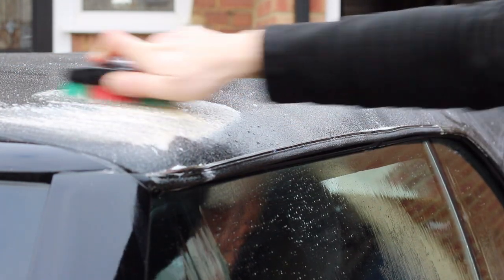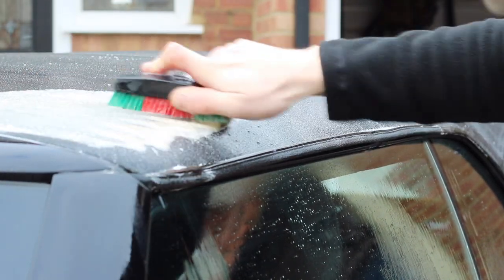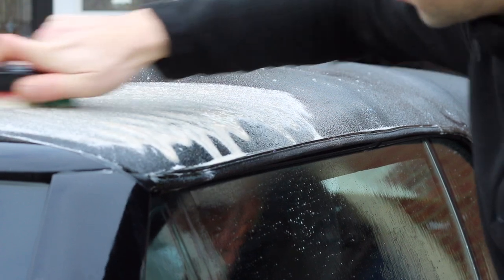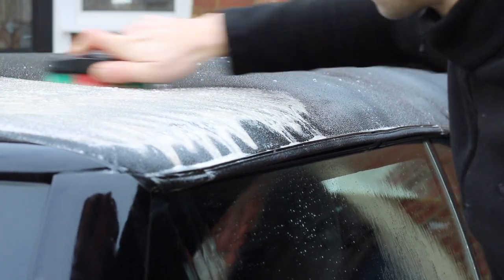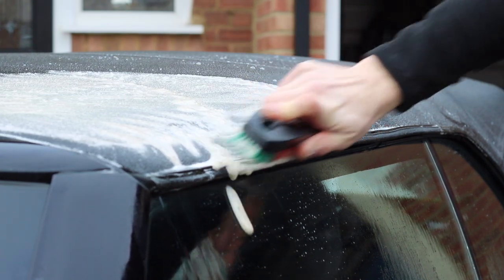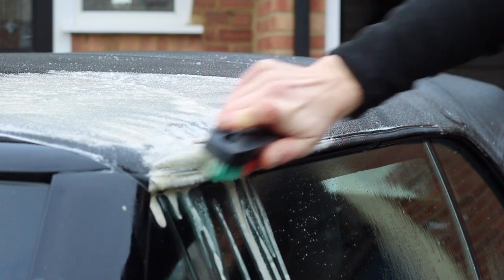and then you want to come back and agitate it. Now, in a modern, good condition roof like this, I had no problem agitating it with a slightly stiffer brush, this one being the Vikan brush. On some of the older mohair roofs, things like that, I might use a softer, more natural fibred brush. But as you can see, the green and the mould is pulling out of this roof like nobody's business.